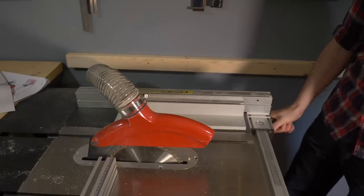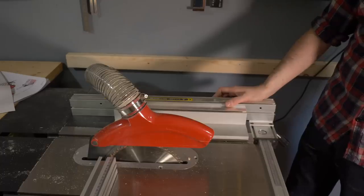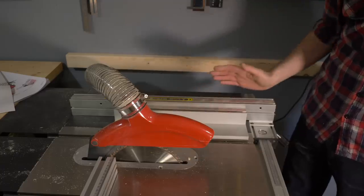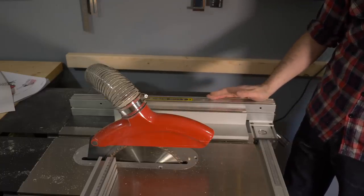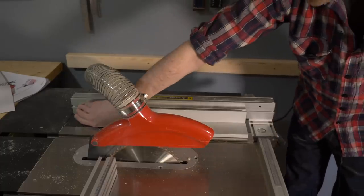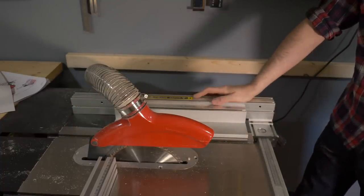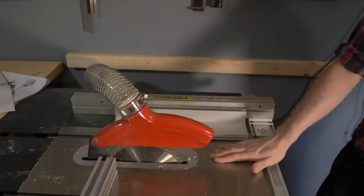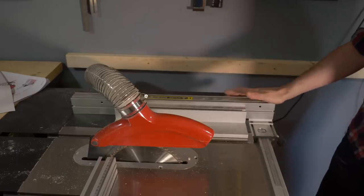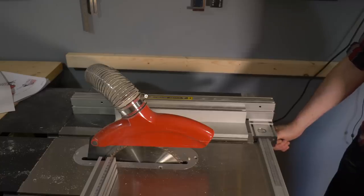A few people were concerned about the fence because it only locks at the front and not at the back. I've used saws with locking mechanisms at both ends and never got on with them - when they lock at the back they tend to twist it out of square, and I've seen a lot of reviews of other saws where people say the same thing. If I really push I can get maybe half a millimetre of deflection, but that's not a problem because you should only be pushing towards the fence before the blade. I've never had a problem with saws of this design that are well made, and this is - so I think the fence is very good.